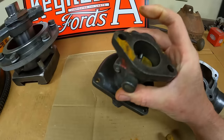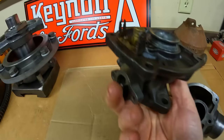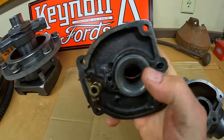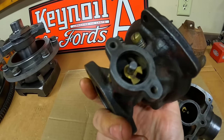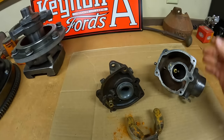The upper portion, or throttle body as it's called, doesn't look nearly as bad. We've got some rust going on on that float pivot bracket, and that old pot metal venturi is pretty well seized in there. We're going to have to try and get that out at least to clean the passages behind it. Don't know what we can save, but I think we can make this work again.